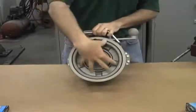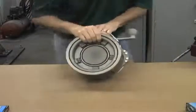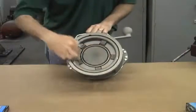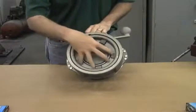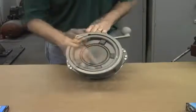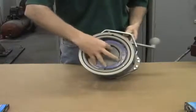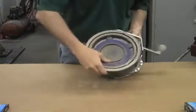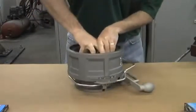The first step is to open the coupler by moving the sleeve forward. With the D4 you have five interlocks on the face of the coupler. All five need to be defeated at the same time for the sleeve to move forward. This can be done with your hands, or you can use a large washer or gasket and press it in. Place the gasket or washer on the face, press down, and it pops open.